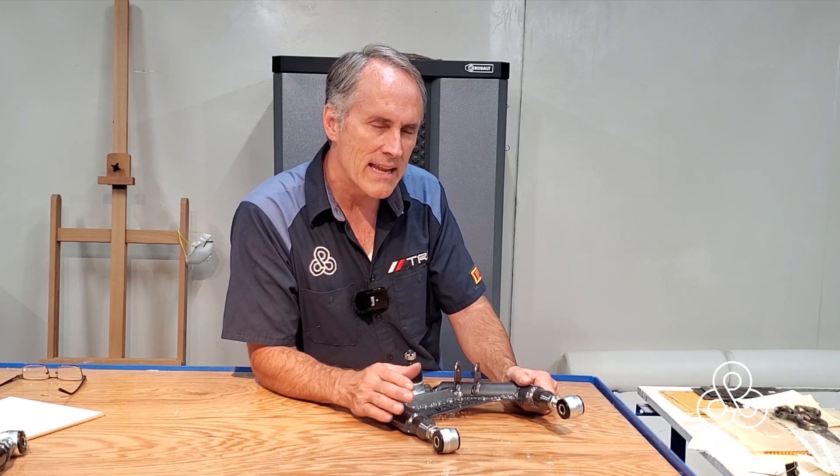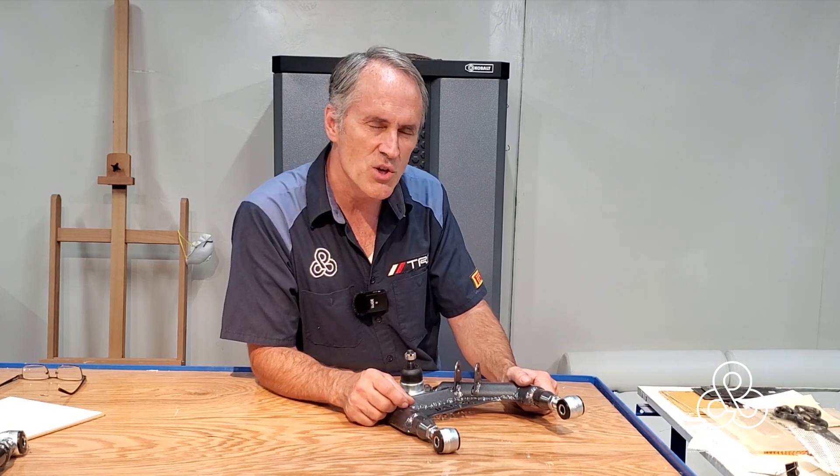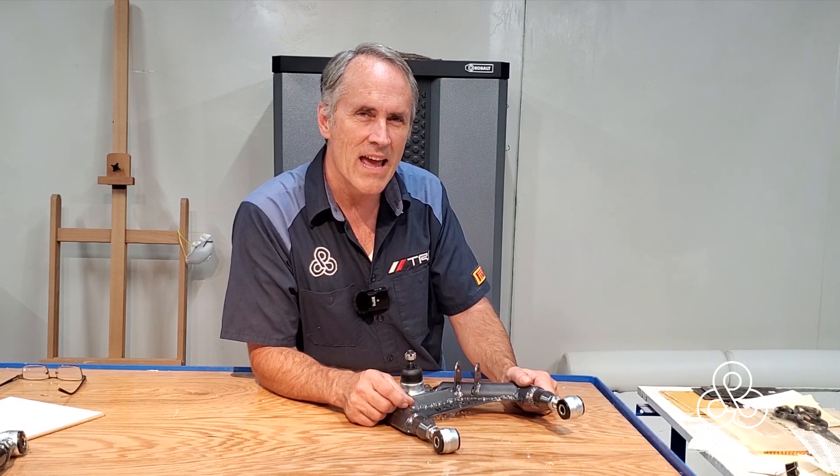The fourth suggestion ties back into material mass differences and cooling. Since we're not preheating, we're just allowing the heat to saturate from our weld, and we do want it to cool down as slowly as possible. That doesn't mean you have to do anything special to prolong the cooling — just don't put it under a fan, and for heaven's sake don't put it into water to quench it. That will indeed induce some serious stresses in the welds.